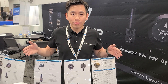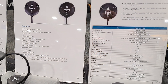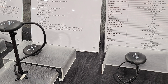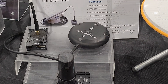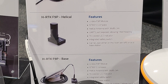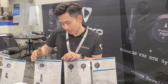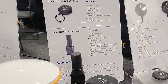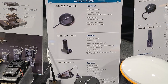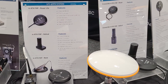These are some of the GPS modules we offer, ranging from something more affordable with meter-level accuracy to systems with centimeter-level accuracy. These high-precision systems are called RTK systems. We offer multiple options in multiple sizes with multiple antenna types. There are two protocols: the DroneCAN protocol that we recently released, and the serial UART protocol. Depending on your budget and the accuracy you need, we have many different models to choose from.